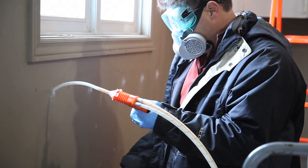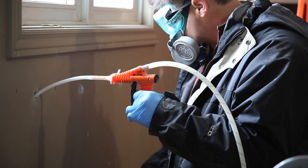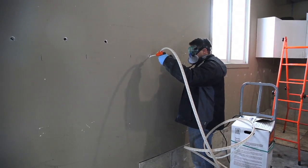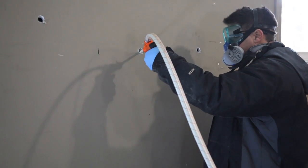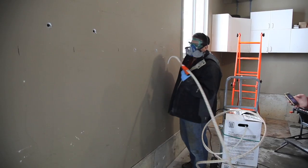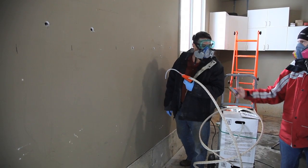With fill times calculated, inject foam into each lower hole. Use your judgment about fill times when you come to narrower wall cavities like those in corners. Accurate filling is a lot easier if you have someone watching the clock and calling out start and stop times. You're aiming for a small amount of foam to ooze out of each hole when you're done. This is easy to clean up later when the foam is hard.